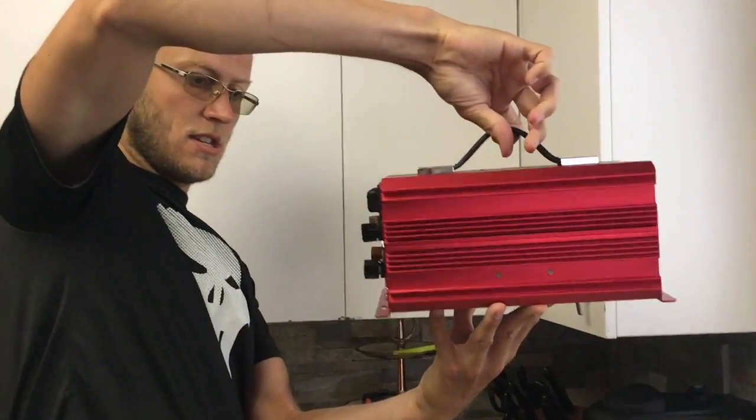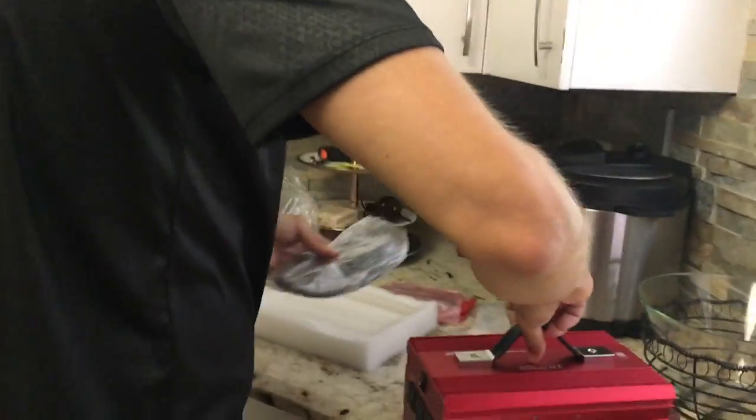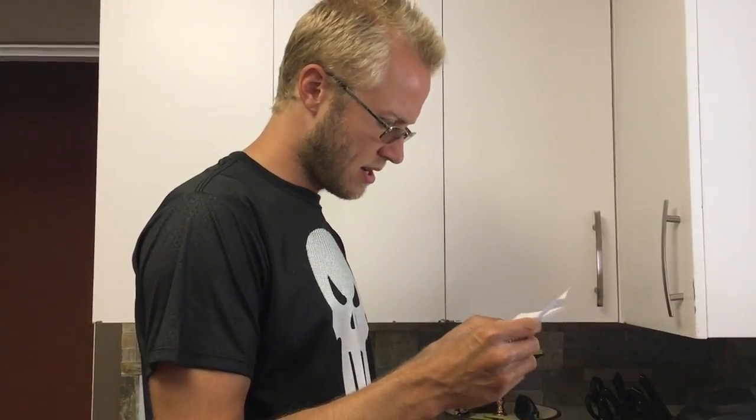Do you want to explain how many volts, amps, and watts? It was 2,000 regular, and then it had a 4,600 watt peak, which means what it can be jolted with right at the start. So if you were going to run a microwave or an air conditioner, the initial jolt of anything turning on is higher than the constant draw.